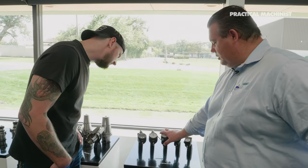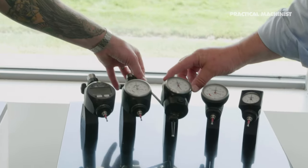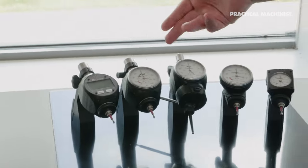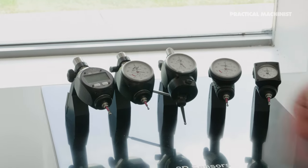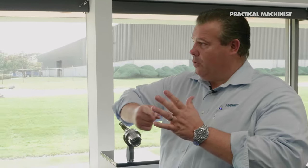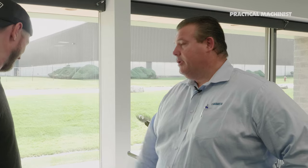The sensor faces the operator while only the probe tip sweeps, so we can find the center of a bore. For example, on a lathe with Y-axis you need to rework a part — you come in with this and find the center of that bore. We tell a lot of shops to use this as an edge finder and indicator to teach an operator how to probe by zeroing the control. It's much more cost-effective at about $450 versus a probe that could cost $12,000 if crashed.